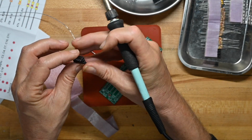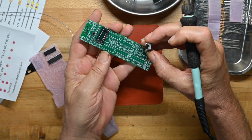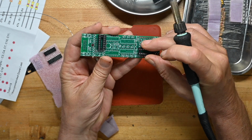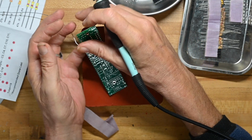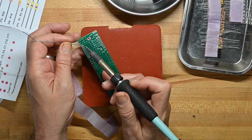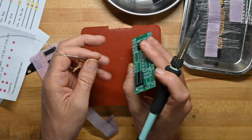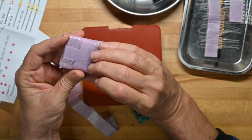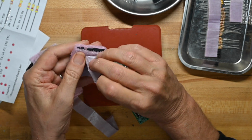Now, of course, you have to be careful when you're doing this. When you're doing this, number one, get the notches in the right place, and number two, since there's a variety of chips on this board of different pin widths, you've got to make sure you get the right socket for the one that has the pins for that. You can't put one that has too many pins in a too few pin socket, but you can do the reverse, and then you can get very grumpy with yourself when you say, oh gosh darn it, I put a short socket where a long socket goes, because then you have to desolder sockets from through-hole plated boards,